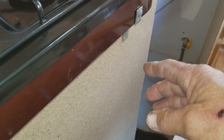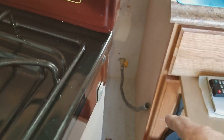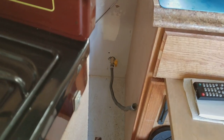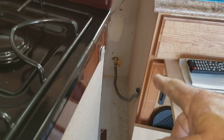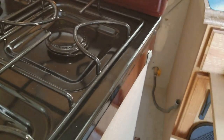Underneath inside the cabinet I store pots and pans in the front, but in the back I had my small 20-pound propane bottle running just the stove. The cabin is all piped into the big propane tanks outside, and that's where the main stove is going to connect. So I got the measurements for everything I need and I'm going to go to my friend Jose's propane place — while I'm getting the small tanks refilled — and have him make me a connector that'll go from the gas valve up to this stove so I can run it off the cabin propane.